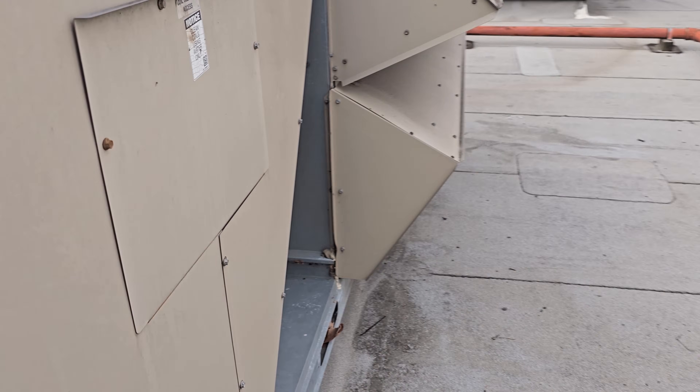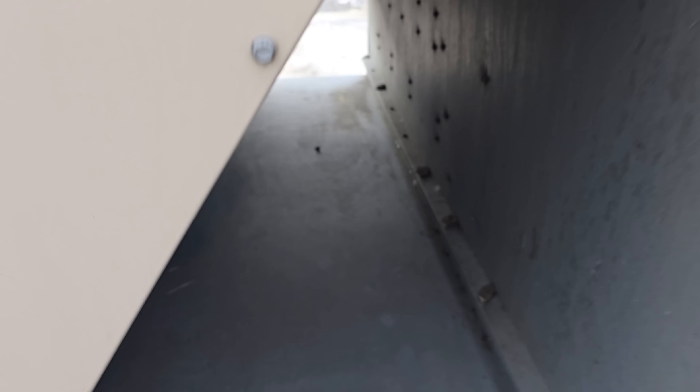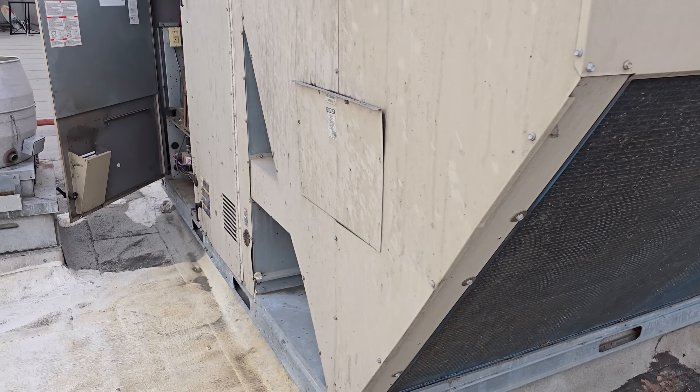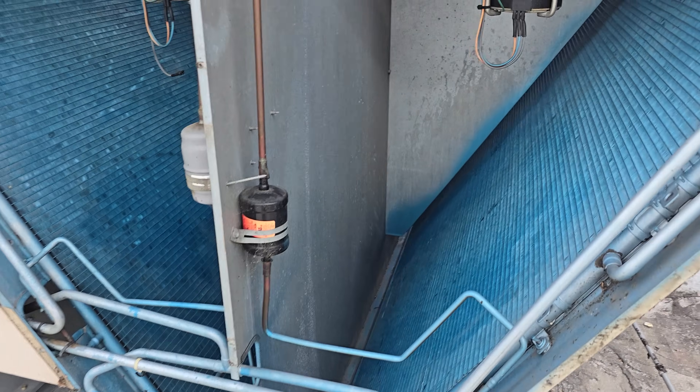It's pretty dirty. Step over here — in here is usually the worst. Yeah, this is plugged. We're going to have to probably start with cleaning this guy because the condenser looks dirty, and then we'll test the fan motors and everything else and see what's going on. Pulling the covers off the condenser so I can clean it from the inside out.